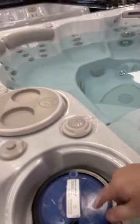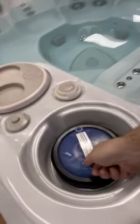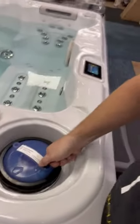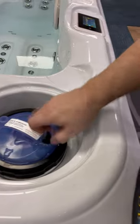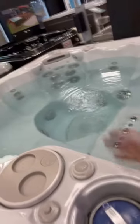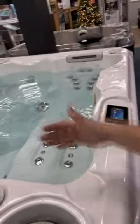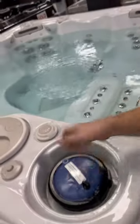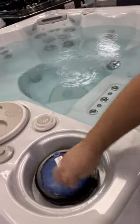You can see some action going on here. Just have some patience — it may not kick on immediately. Try to bleed it again: loosen that off again. It's okay if water comes out, we kind of want water to come out. We want this air to escape — and here we go. We can see the motion in the water, the pump is actually catching some prime right now.